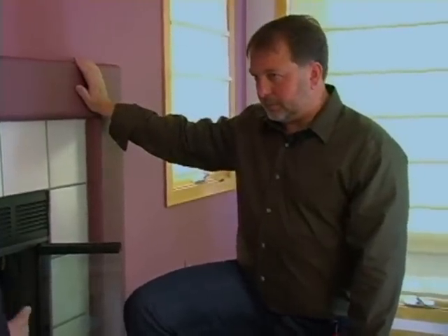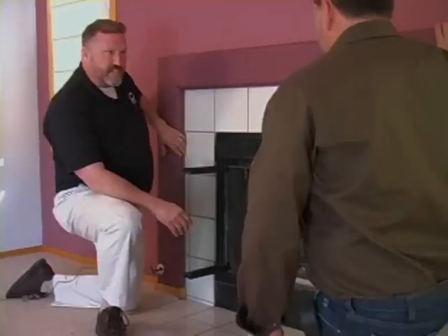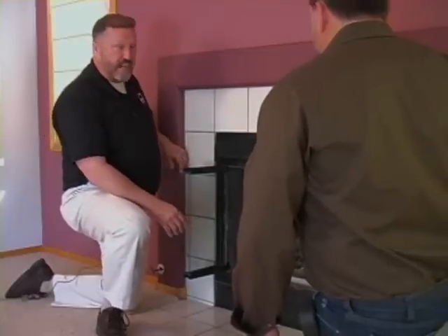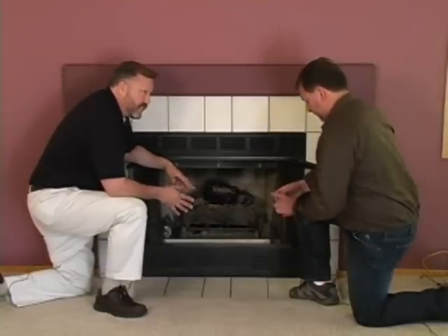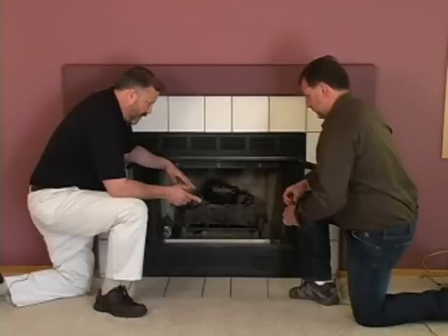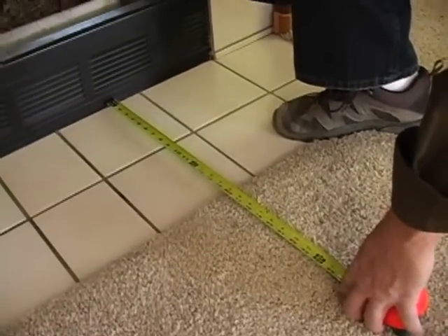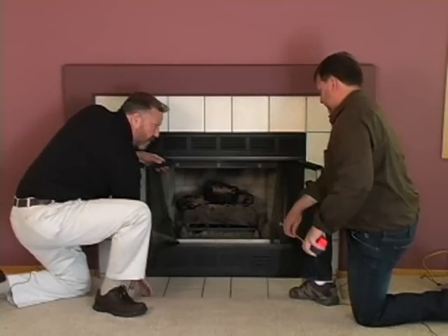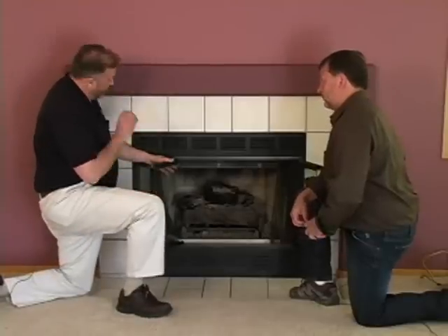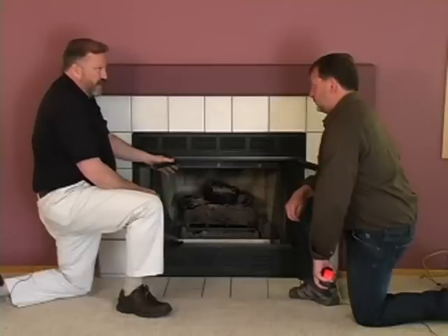What about around the fireplace? Certainly — we're concerned with what we call decorative surrounds. A lot of people love to put things around their fireplaces. You'll notice there's a clear distance to any type of flammables on the sides and in front. In this case, we measured this and it's actually a little bit short — we want a minimum of 16 inches here, and it's just under 16 inches. The reason is embers — when you open the door, embers can drop out and fall here. They'll sit there and smolder for days sometimes. It's very dangerous at night when you're asleep and an ember is sitting there — you could ignite the whole house.